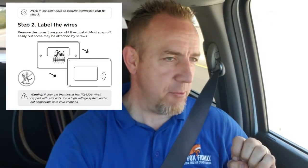When homeowners do it, it can be a little more challenging because they may not know all of the low-voltage wiring. When they open up the book they see things like: take the C wire, the R wire, the W wire, the Y wire, and the G wire, label them all with the pre-made stickers. It can get confusing. A lot of people end up getting caught up in the part where the common wire comes into play.